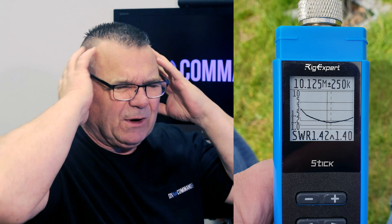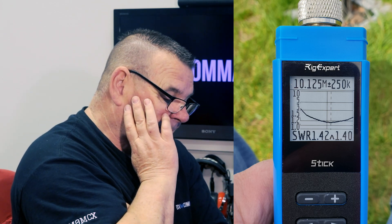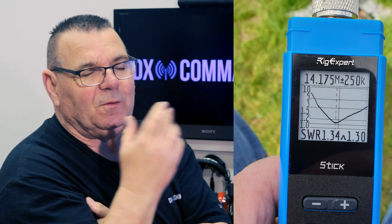That coil that resonates on the 80 meter element gives us a kind of 5/8 loaded three-quarter wave thing on 30 meters at 10.1 MHz — that's as flat as a pancake for the whole 30 meter band. 20 meters is about 300 kilohertz at 1.5:1 each side, and 500 kilohertz — that's half a megahertz — so it would be from 14 to 14.5 at 2:1 band edges. I think 300 kilohertz at 1.5:1 is fantastic. Then we go up to 17 — 17 is quite a small band, so that's easy to make an element that resonates across the whole band.